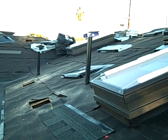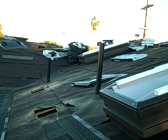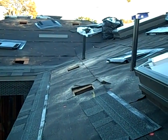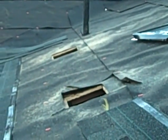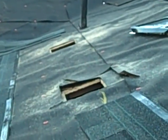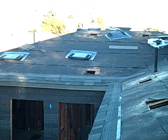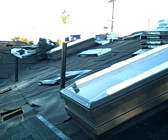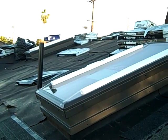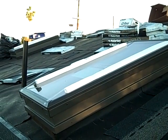The pipes sticking up out of the roof are where the gas is basically. You have your plumbing and the drains that go down — you need air flowing into those areas to have good enough suction. There are also some holes in the roof; those are in the attic and that's where if you have hot air, it comes back out of the house, giving you adequate ventilation. The roof is almost completed — shingles all around, flashing in place. There are actually two skylights on the house and this should be done in the next day or so, but moving very quickly.